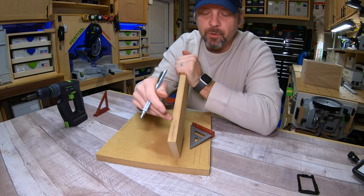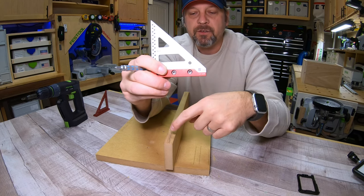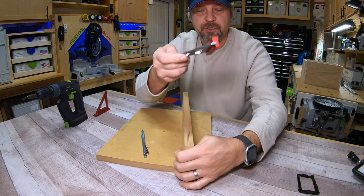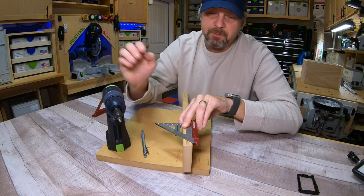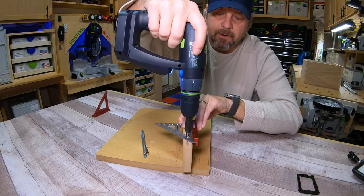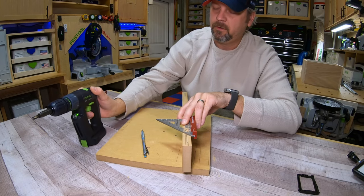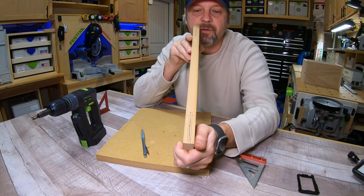There's also a hole right here that's perfect for drilling dead center of your three-quarter-inch stock - for hinges or whatever. This milled-out hole fits the tip of your Vix bit perfectly. You can lay your square on the stock, drop your Vix bit into that hole, and drill wherever you want to put your holes. It lays it out right in the center, and you can see how that lines up with the center lines I already scribed - it works out perfectly.